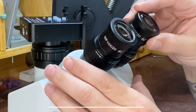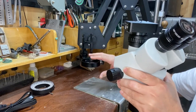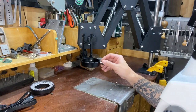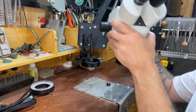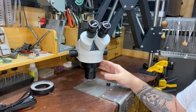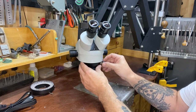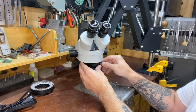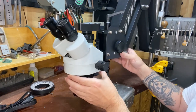Do that to the other side as well. Once we've put all the parts of the microscope together, it's time to load it into the collet. We're going to simply slide that in — you'll notice the collet has a screw knob that we can unscrew completely. Then carefully place the diaphragm so that it's sitting nicely into the collet itself and use the screw knob to tighten that up, so we don't have any movement in the actual microscope piece itself. It'll sit nicely up against the arm and then we're ready to move on to the next stage.